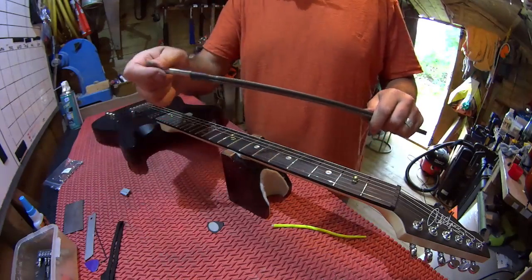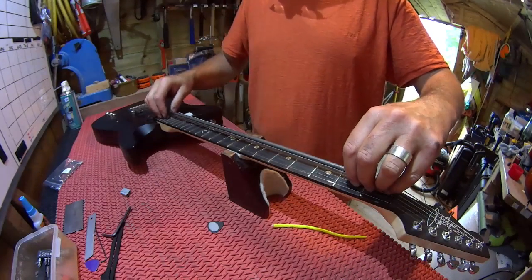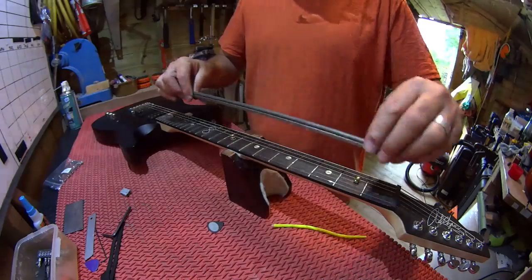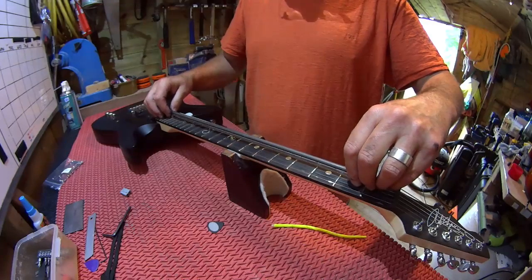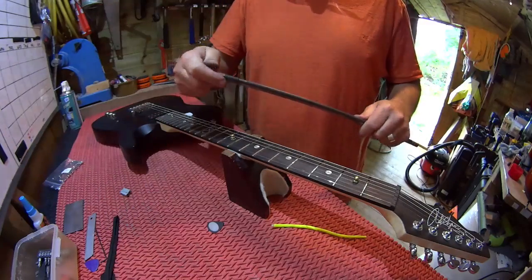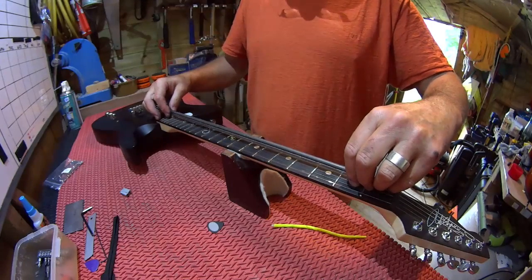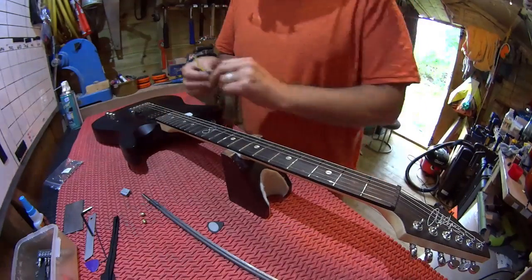We don't want to sacrifice playing life of the frets for something that is purely cosmetic, or mainly cosmetic. Right, get in there, you. This is being slightly thrown out of whack by the fact that these brass nuts are currently sitting on the paper fret markers. I mean, it's a whisker of a difference, but with these sort of tolerances, it is actually a difference. So I'm going to go with that, but I wish I wasn't sitting on paper.